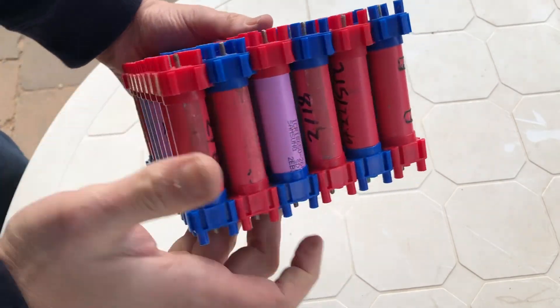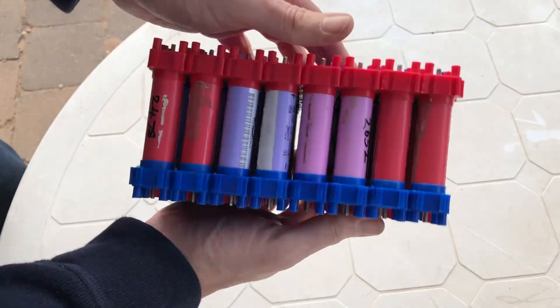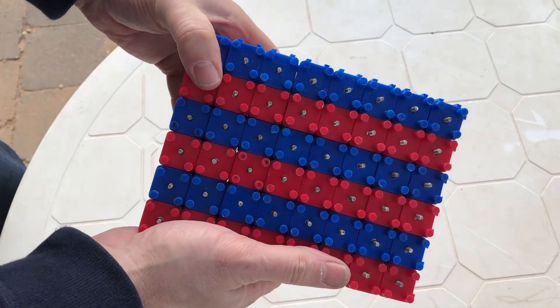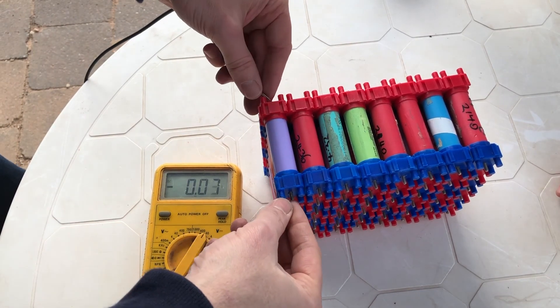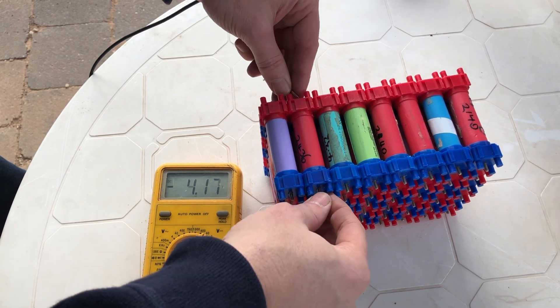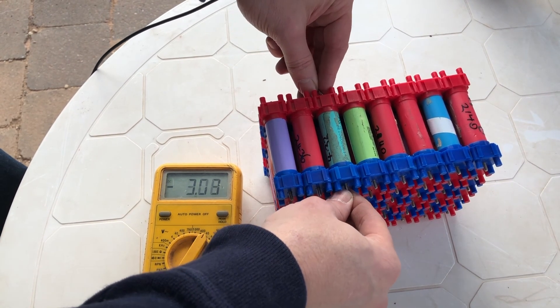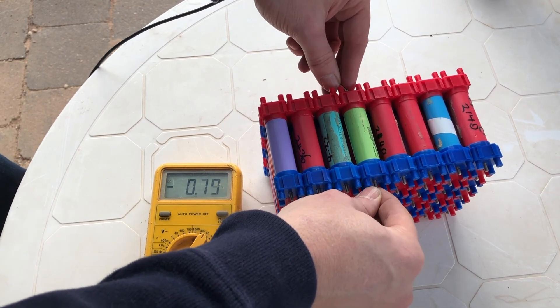You can see I have the Vrouzen end caps on both sides of the battery, set up for a 6S 8P configuration — parallel banks of eight batteries alternating in polarity orientation to put six banks in series. Before installing the nickel bus bars, I'll use my multimeter to check the voltage contact coming through each cell's end caps, just to make sure every cell has good contacts.